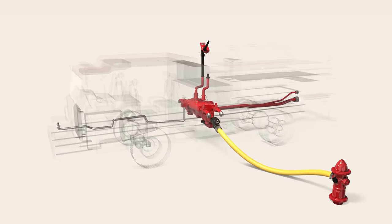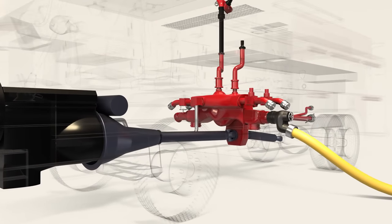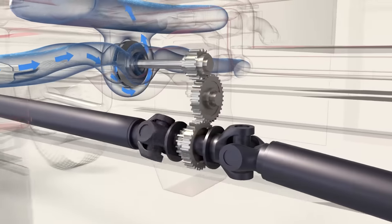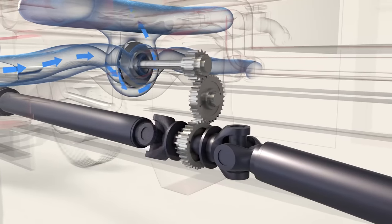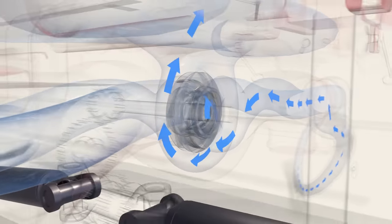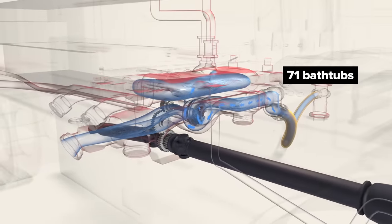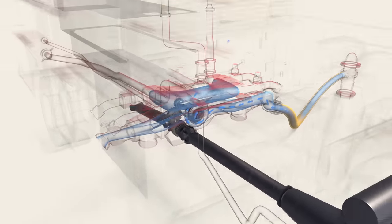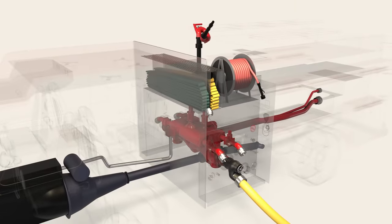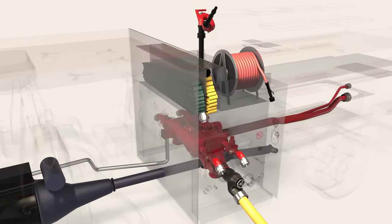This particular pump is a centrally located midship design, powered by the diesel engine through the drive shaft. A metal rotating disc with internal fins called the impeller performs the pump work. The pump is rated up to 3,000 gallons per minute, which is about 71 average-sized bathtubs full of water every minute. Two-and-a-half to three-inch diameter hoses in a cross-lay compartment allow for quick access from either side and may be pre-connected for fast deployment.